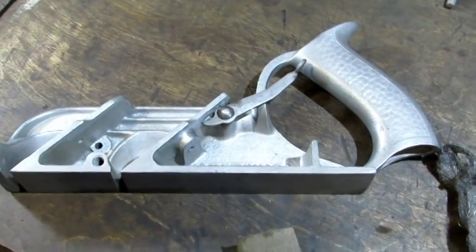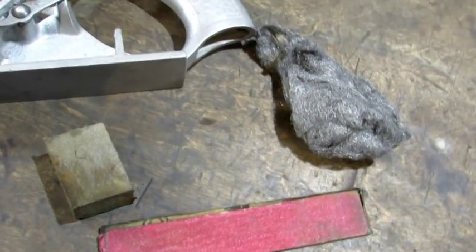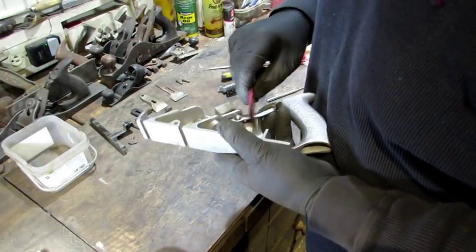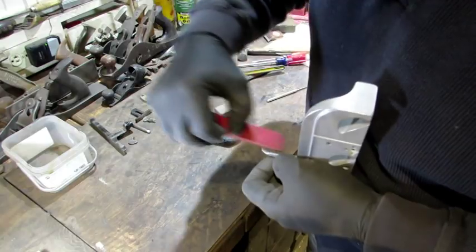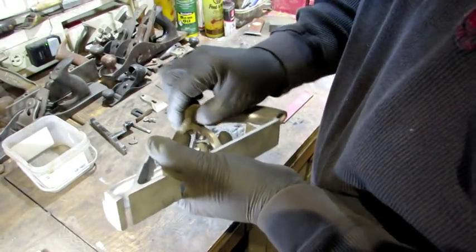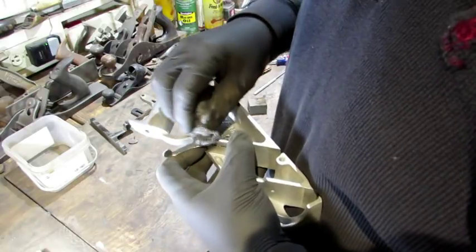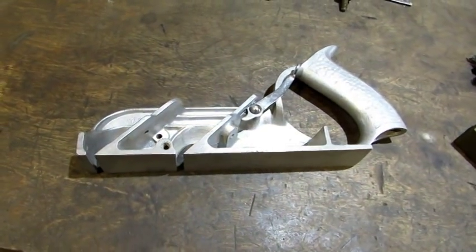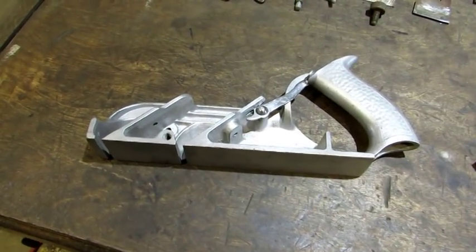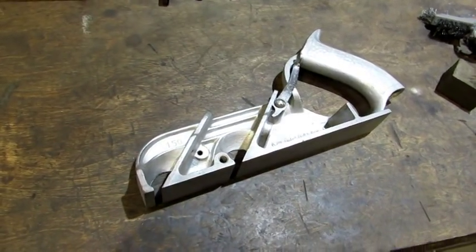With the steel wooling of the body done, I'm going to use a piece of sanding sponge that I cut down smaller, a sanding stick, and my 4-0 steel wool to work on that depth adjustment lever. The sanding stick is first, then the sanding sponge, and finally it's going over with the 4-0 steel wool. With the depth adjustment lever done, it's time to move on to the machine surfaces — I'm going to lap those. It's both sides, the bottom, and the lower edge where the iron comes through the throat. I'm going to use the sandpaper stick to get that part done.